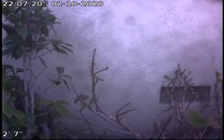We're going to run our camera back in so we can videotape again and re-inspect the line. From what I could see during hydrojetting, the rest of the 6-inch city lateral looked to be in fair condition. There's some root intrusions in a couple other areas.